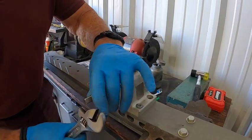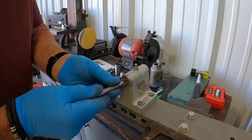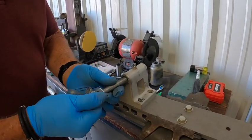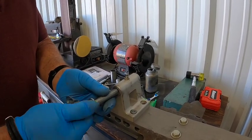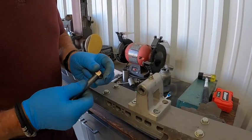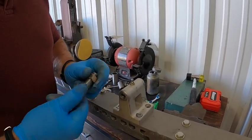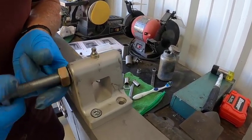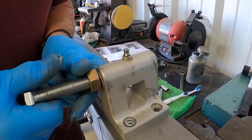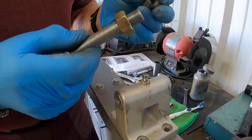This is a little crooked — we're going to remove this now. I think we've got enough thread engagement. Let's do a trial fit — put the nut on first so we can measure it. See how much we've got. We'll back it off and see how much engagement we've got. That's about equal, so we're good. You don't have to go all the way through with the tap.